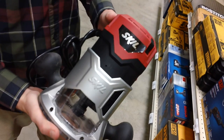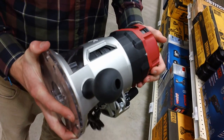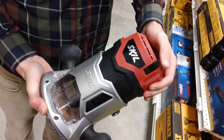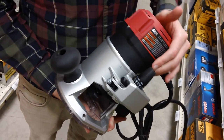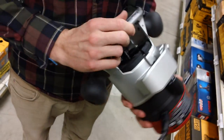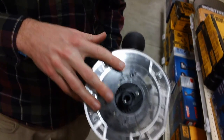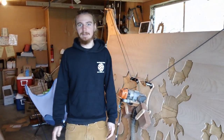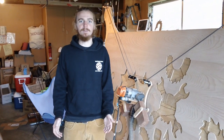This is a fixed-base router from Skil that I actually like quite a bit. It's not variable speed, but other than that it has sort of everything you're looking for and it's a bit cheaper than the RIDGID router. The on/off switch is on the top, which is super convenient. You set the depth on the back and the adjustment would be pretty easy to automate. It looks like it has a dust collection plate that would bolt in, and it has two lights on the bottom. We didn't look at every router from every manufacturer, but I think we covered the general range of features available.